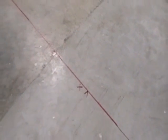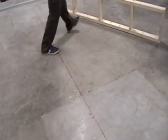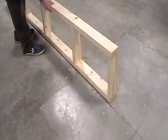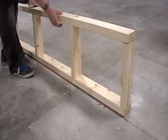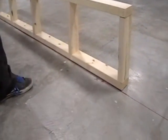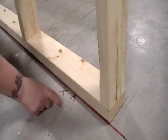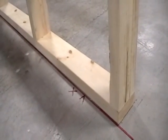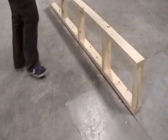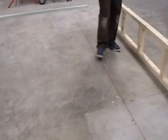I've got a red mark on the floor here which tells me where the first wall goes. So I have a little wall here — I can put that right on the red mark. Now let's say I've got another wall that I want to line up right at this point, where the X is, and I want that wall to be at 90 degrees to my first wall. I can use a 3-4-5 triangle to lay out my second wall at a perfect 90 degrees to the first wall. Here's how that works.